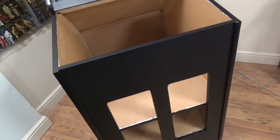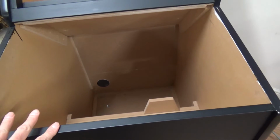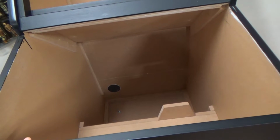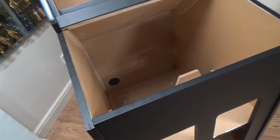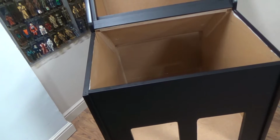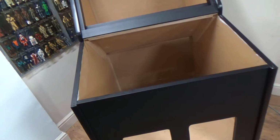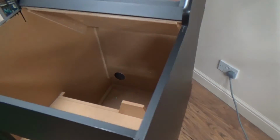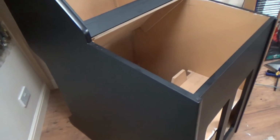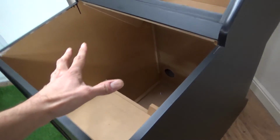But I just want to explain about the control panel. Now, the control panel I've cut up already, and it's 18 millimeters. I'm thinking of getting, if they do an MDF in 15 millimeter, and then maybe 2 millimeters of a metal sheet, and then maybe putting an acrylic over the top of the control panel to protect the artwork. I haven't decided yet. I don't know what you think, guys. Should I do that, or should I just keep it like the original? Bear in mind that you're going to get wear and tear on the control panel, and the acrylic's going to protect that artwork.